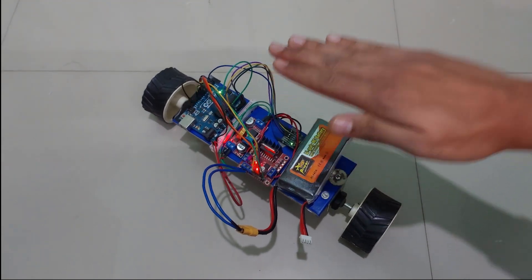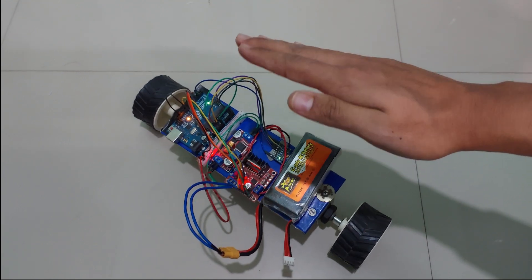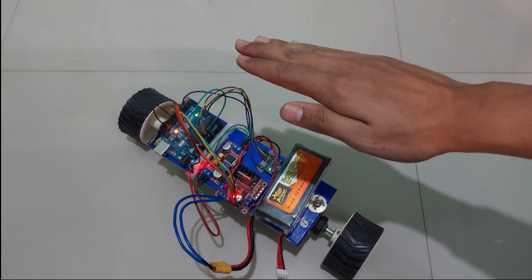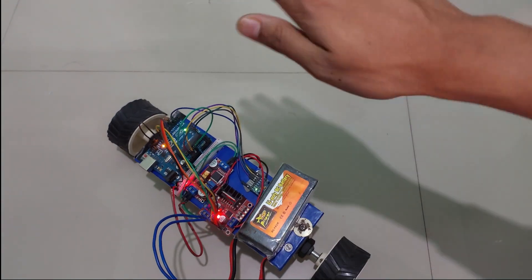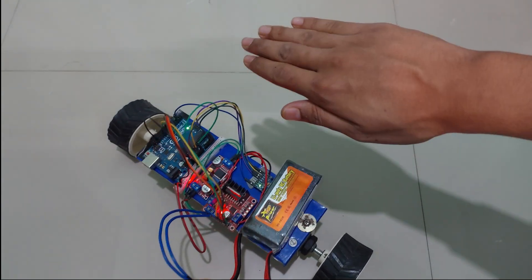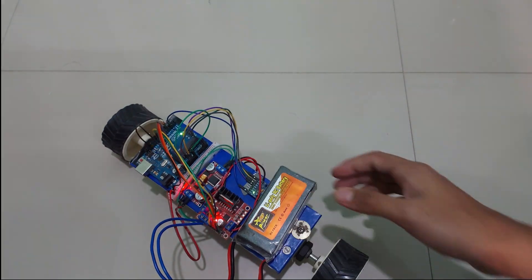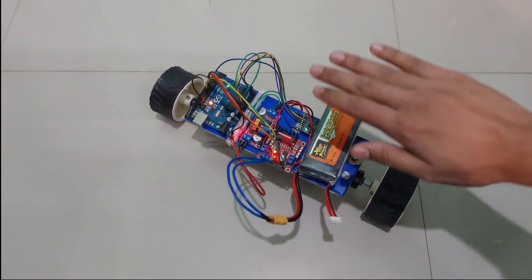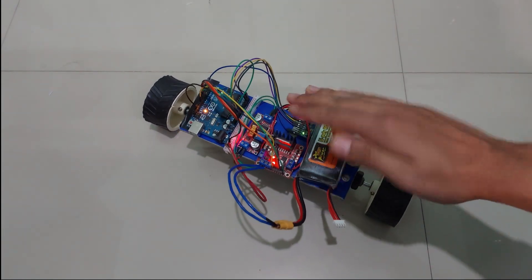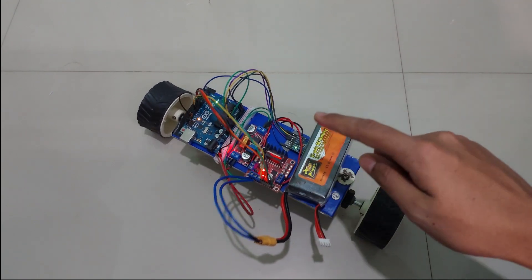Say it's supposed to be like this when straight and balanced. If it tilts, the sensor detects that and asks the car to twist the wheels and move backwards to give a little bit of torque in the forward direction, trying to balance the car. When the car is falling forward it moves forward to give backward torque — it's basically a constant loop called PID.